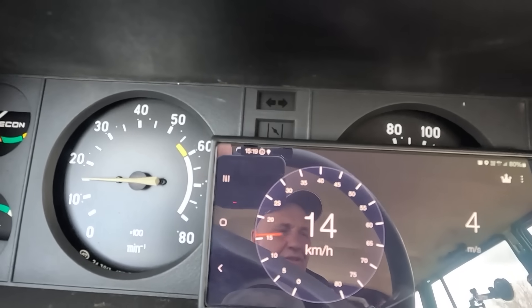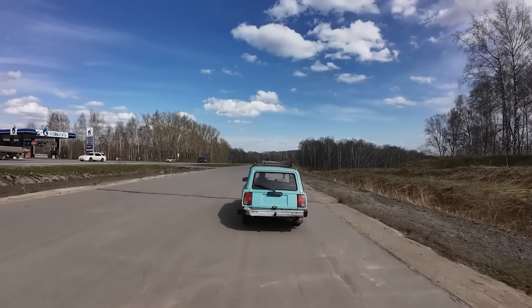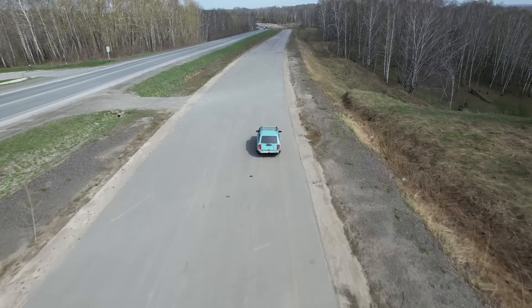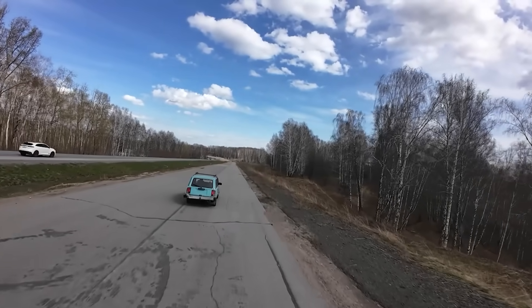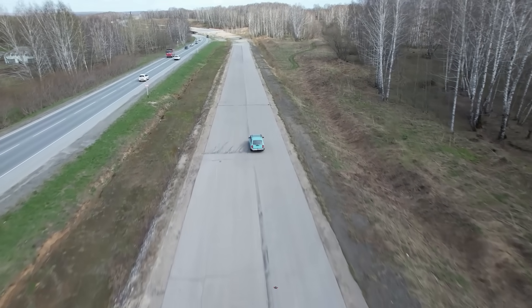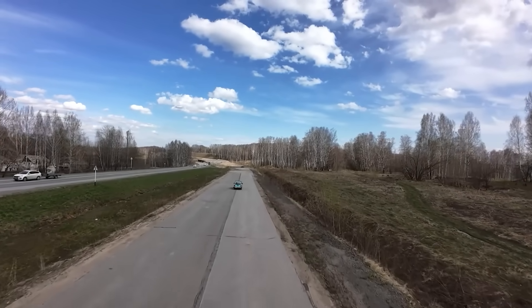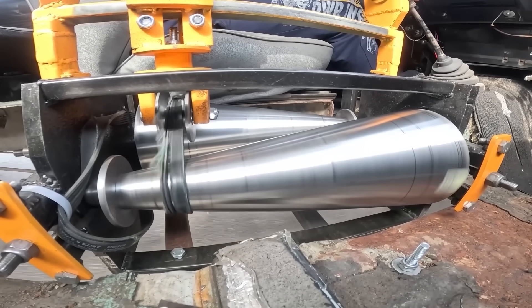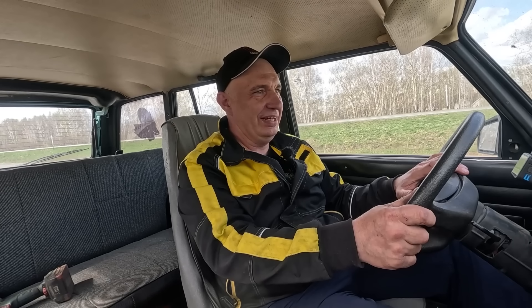Okay, that's second gear. Third gear — and here we go. It is struggling, and the engine is getting loaded up. Squealing, slipping — maybe ease off the gas. The screwdriver is struggling now. We've topped out — so much buzzing. 60 km an hour and I am quite happy with that, very happy indeed. That's definitely belt I'm smelling. Not a lot of smoke though. But you probably heard it yourselves — the belt was slipping like crazy, which sucks.